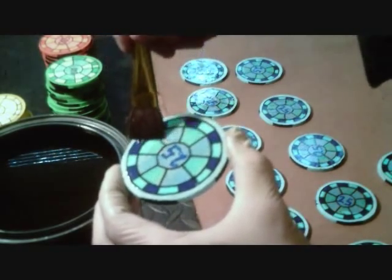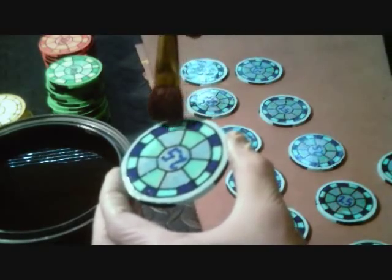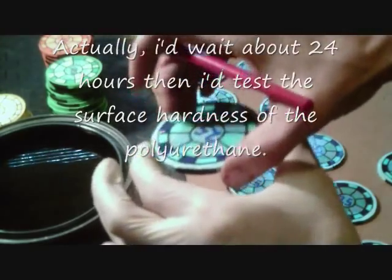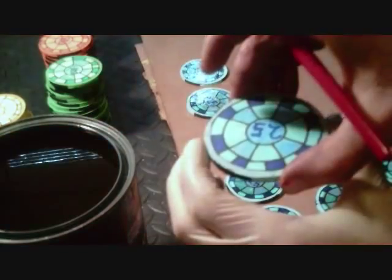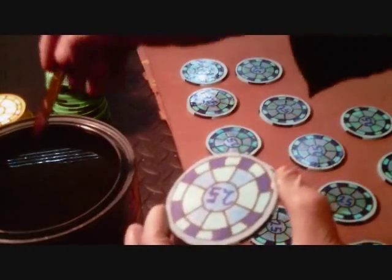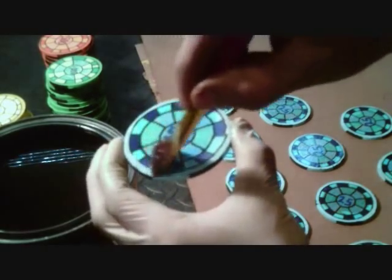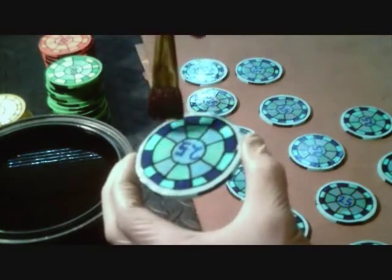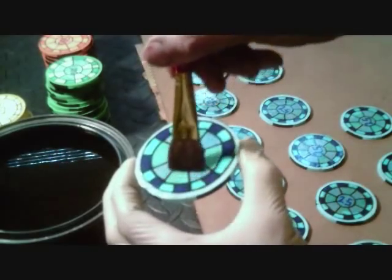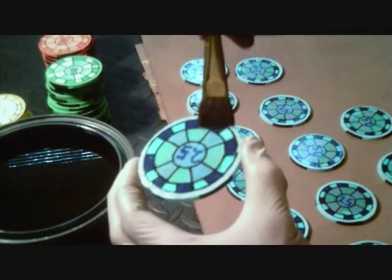It all depends on how hard the surface is when it cures. If I can push my fingernail into it after 10 hours, then I'm only going to go two coats. This can of urethane has been out in my building for 10 to 15 years, probably been frozen a few times, but I opened it up and it's still good. I tested it — I painted some wood with it about a week ago and it cured up fairly well. It still performs like it says on the label.